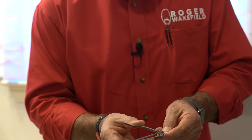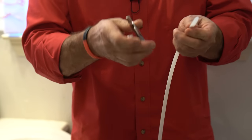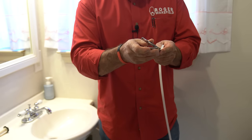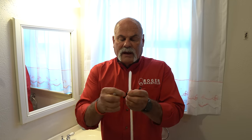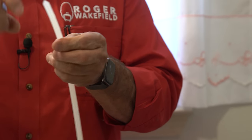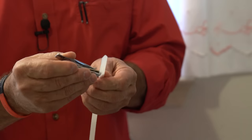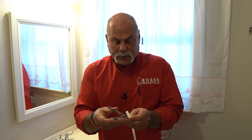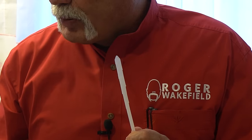Line it up right here towards the end. Cut in — and you heard it click right there. Then you kind of twist it a little bit to make that hook stick out. Come off about an inch, do it again. I've gone through now and cut four little barbs in it, and when you rub your finger up you can feel it. Then do the other side right in between them so you don't accidentally cut it in half. Now I've got one I made — it's got hooks on it, it's going to grab the hair, it's going to pull it out, and it'll probably last longer than the other one.